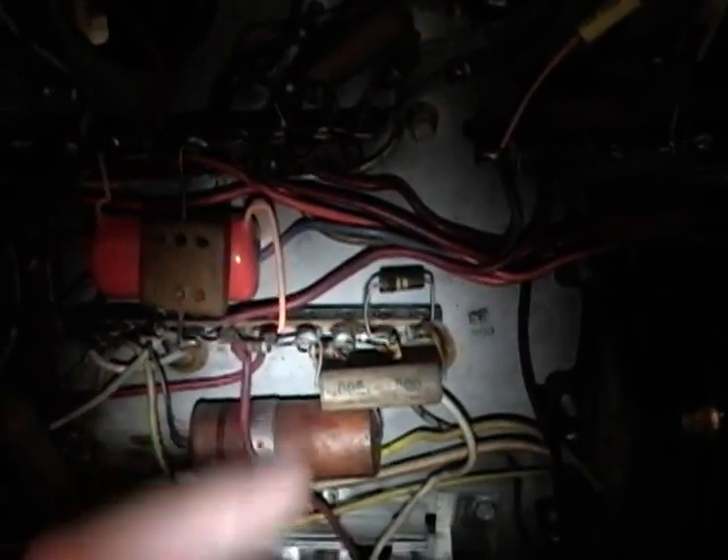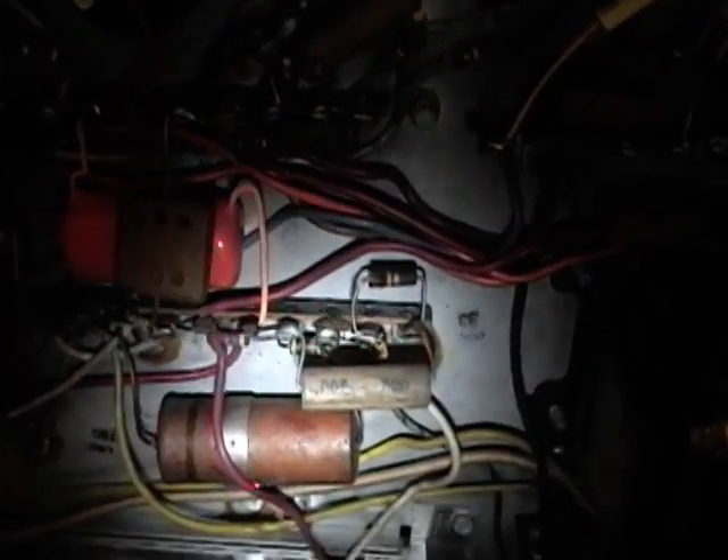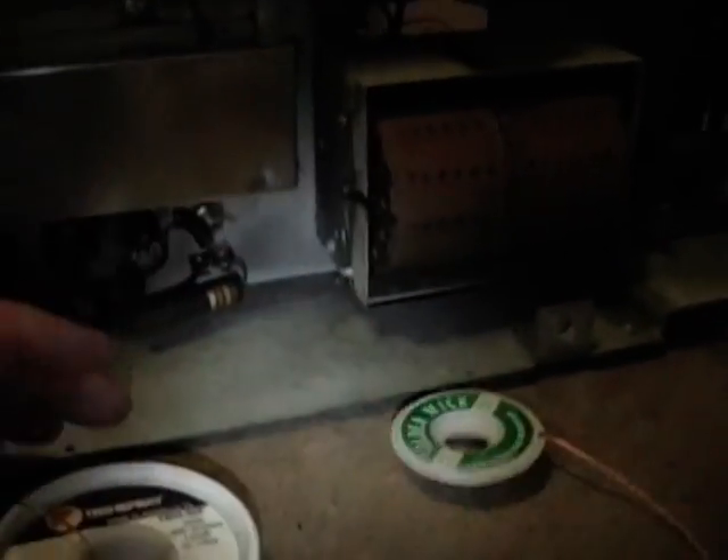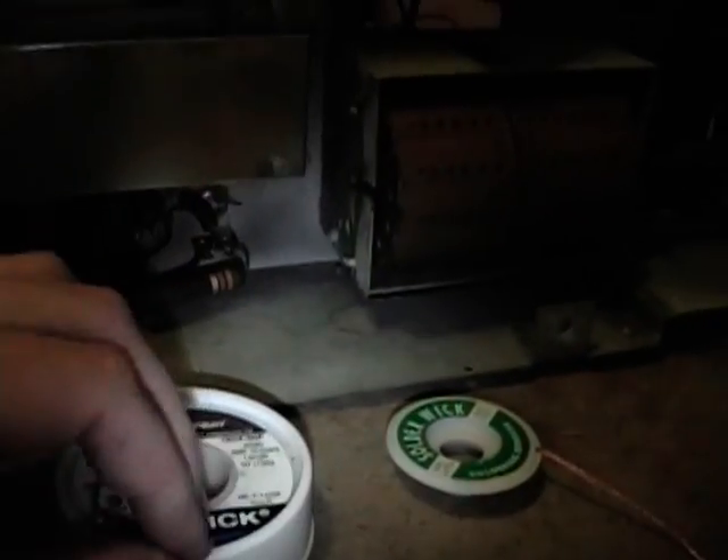You can also just cut the old lead short and wrap the new lead around the post, but that gets messy. When I see repairs like that, I actually unsolder and remove all the old leads, because it just builds up into a big blob that can short out to an adjacent terminal. The other technique I use is solder braid — actually removing all the solder and unwrapping the leads to get down to bare metal. I go through a lot of solder braid because these older sets use a lot more solder than you'd find on modern circuit boards. I started with smaller spools but was blowing through them fast, so now I buy gigantic 50-foot lengths of double-wide solder braid.